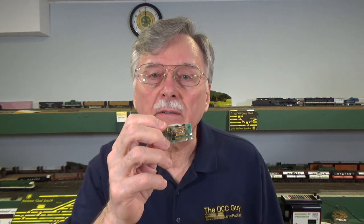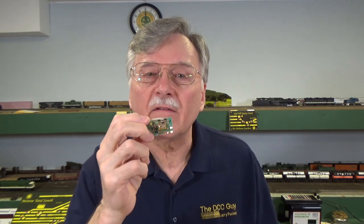One of the problems with these capacitors and chokes is they can filter out that back EMF. Therefore, your motor control degrades quickly. And the same goes for the pulse width modulation — they can mess with the pulses. So you've got two things that are not working right.